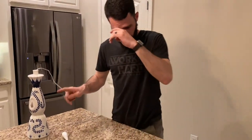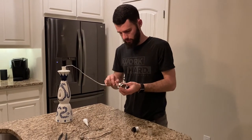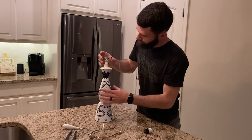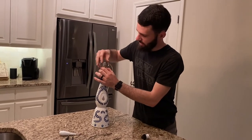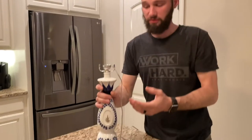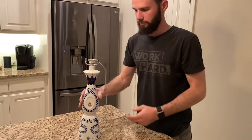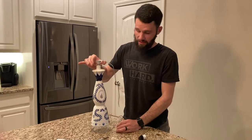Now that the wire is through and we have the harp bracket pre-mounted, we feed the wire through the socket and we're ready to force the rubber spacer into the bottle neck. Keeping everything as straight as possible with the center of the bottle, there will be a little play and we can always turn it later. It definitely takes some force — and it's in there, held solidly.